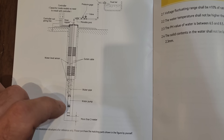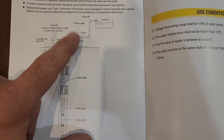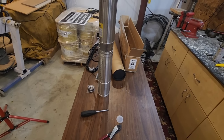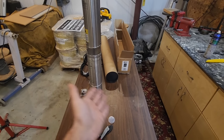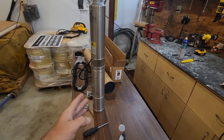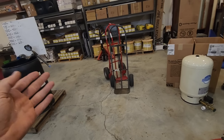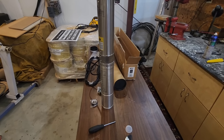So basically this pump is meant for cistern-style hookups. That's why it comes with 25 or 30 feet of cable — you could put it in the cistern or in the well and allow it to dump into the cistern. But it's only a half-horsepower pump, so I'm not expecting great depth capability. Most half-horsepower pumps max out at around 120 to 140 feet. So let's go ahead, wire it up, and see what this thing flows.